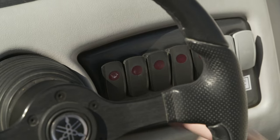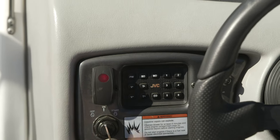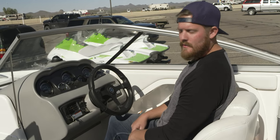Buttons up here: the stereo button is right here, the bilge button is right here, and the blowers are right here. Run the blower and bilge once every hour or so, or if you've been sitting for a while, run it a few minutes before you start going again.